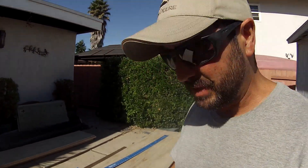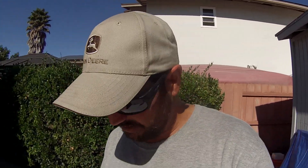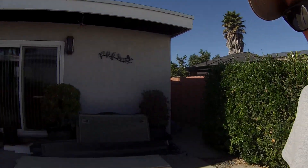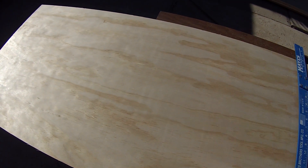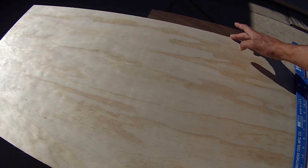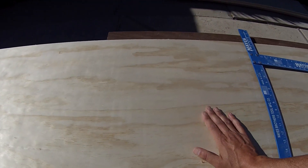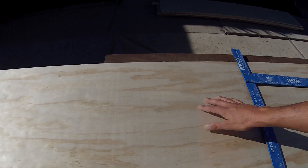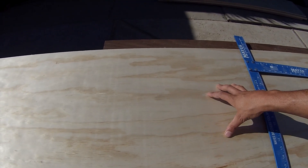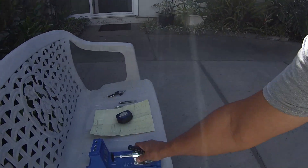For wood I went with three-quarter inch pine plywood — actually a little less than three-quarter inch, it says 17.5 millimeters. They were four by eight sheets. While I was at Home Depot I knew I wanted my desk and kitchen countertops to be 20 inches deep, so I had them cut two 20-inch wide pieces out of each sheet. I've got a total of four of those plus the leftover pieces I can probably use for something. I tried to keep everything the same width to minimize cuts and get the most out of each sheet.